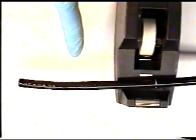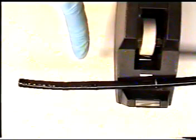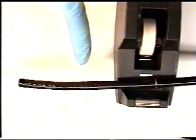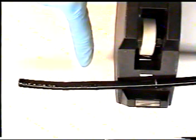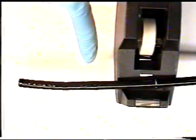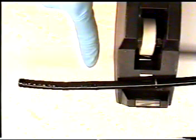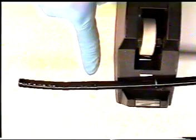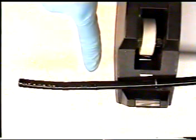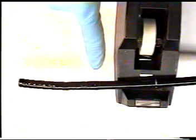It is advisable to let your bending rubber sheath epoxy dry overnight and at least 24 hours. This will allow the epoxy to set to manufacturer specifications in order to withstand repeated sterilization. If bending rubber epoxy is not let to set dry properly, it will chip off endoscope during sterilization and possibly even during examinations. It is very critical that your epoxy is allowed to dry properly overnight.